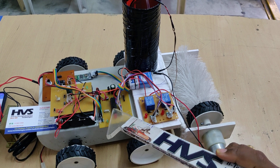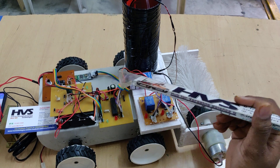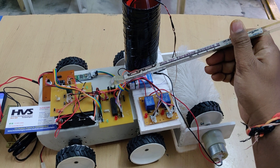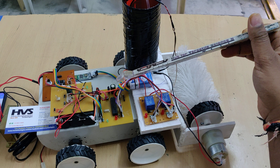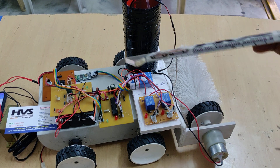When we are providing 12 volts DC input to the system, we need to provide only 5 volts DC to the microcontroller and the Bluetooth module. For that purpose, we regulate the voltage using this 7805, which regulates voltage above 5 volts down to a constant 5 volts DC output.